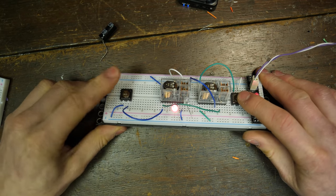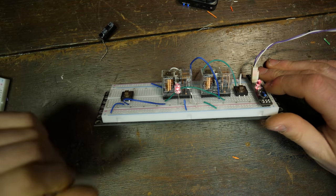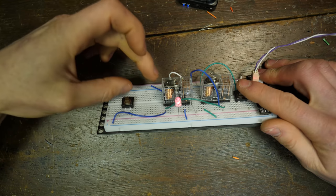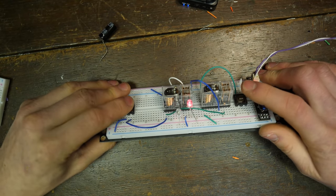So now with 2 relays, you've basically got this. And you can keep on adding relays like this and adding complexity. For instance, if you only ever wanted this decision to be made on a clock pulse, well, all you do is you add another relay that isolates it when the clock isn't being sent in. And then you'll make it a synchronous latch.